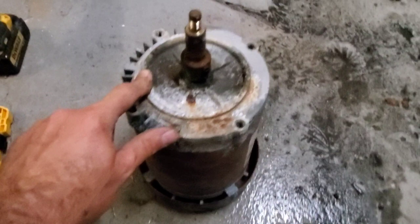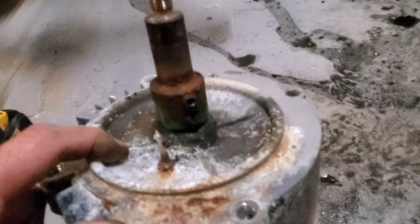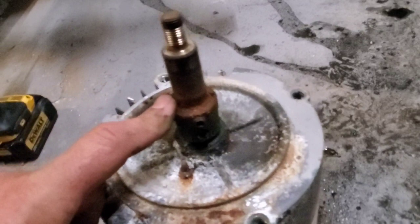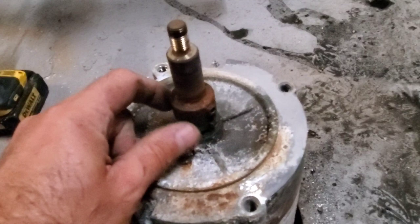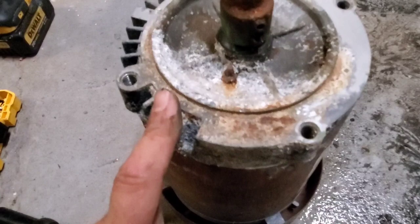The pump is off and I'm seeing this water damage — I don't like what I see in here. I tried to drill through these set screws and one just broke right apart. I think we're going to be so seized up and rusted that we'll cause damage to the shaft trying to take this coupling off. So I've got approval from the customer to replace the whole entire motor. We're going to get a new motor, a new pump, and some new fittings. What we're going to do right now is put the pump together as best we can without fastening to the motor. We'll get a new motor, and there'll have to be a continuation to this video once we get the new motor.